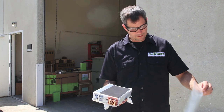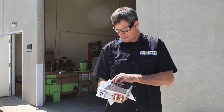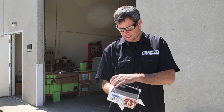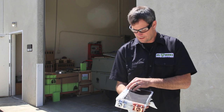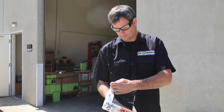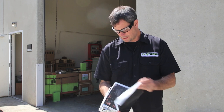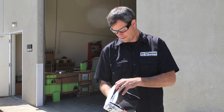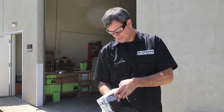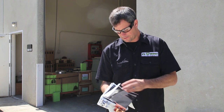But this is what I wanted to show you. We have a little protective layer there, and then inside we get into the anodes and the cathodes. They're basically just a little carbonized copper sheet here, and then underneath that is an aluminum foil sheet. And it just kind of repeats all the way through — that's essentially your battery.